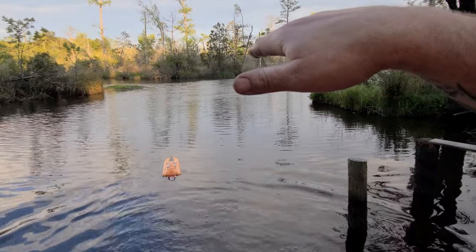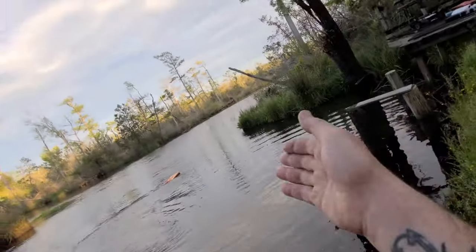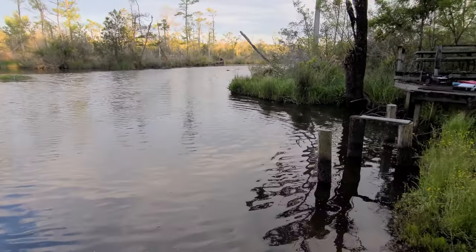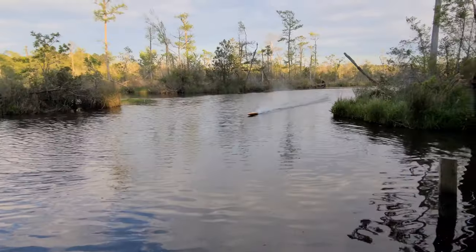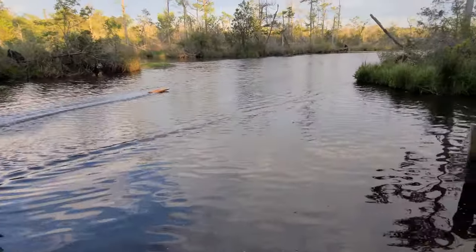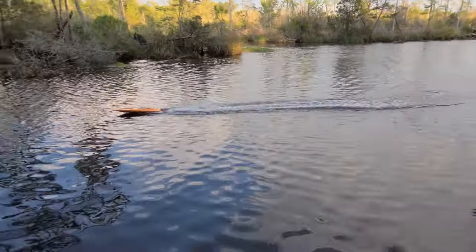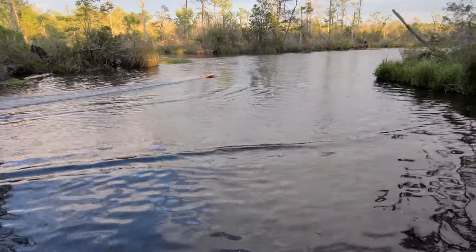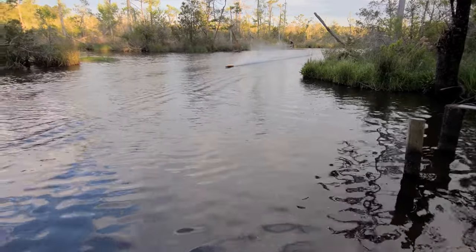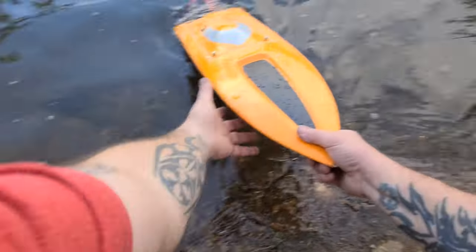That will actually take care of some of the torque - prop roll torque roll - when the boat takes off. She wants to spin to the right most of the time with a big prop on it. So you can actually put the tab up out of the water - less wetted surface. See how she wants to bounce now - way less wetted area. So let's try to find its happy medium. That's a little bit too high up - that was the highest extreme, and we had the lowest extreme.